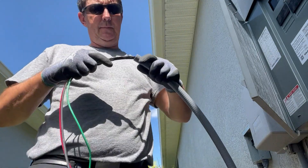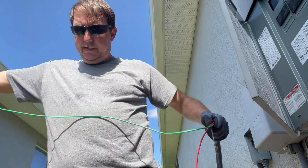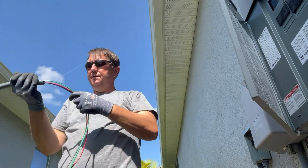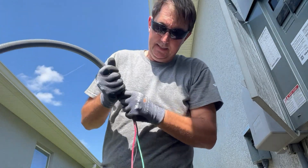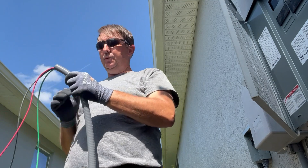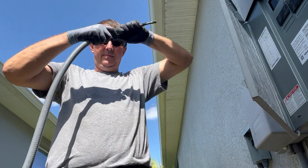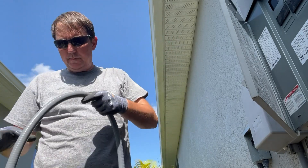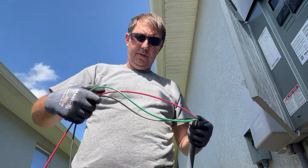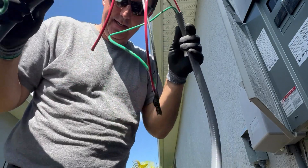This is the size of the pre-cut conduit. I'm going to go ahead and feed some wire in here. I don't want the homeowner to go too long without AC, so I'm going to do as much as I can now before I disconnect the AC. Feed this with how much wire I need — sometimes it's kind of hard to feed it in just around a corner. Step on it, hold it straight, feed this straight down and pull right in. It'll come up the other side. Pull extra so you have it. The ground works out perfect. We'll cut some extra on the other side. We have our flex pre-made, ready to go.